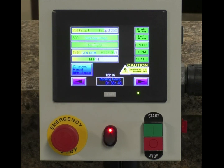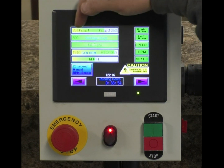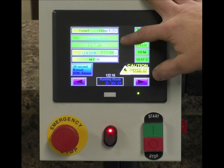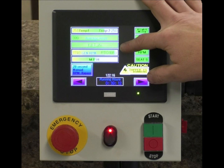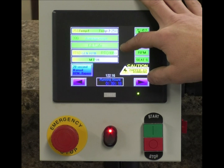A couple different indicators of overloading: number one, we see that our generator temperatures are running pretty warm — we're seeing 250 and 251 degrees. Our amperage, running a 16R30 model, is at 399 average amps, so our amperage bar is green. Our kill rate bar, which indicates our voltage level to the front bar, is in the green, so that's at a good kill rate.